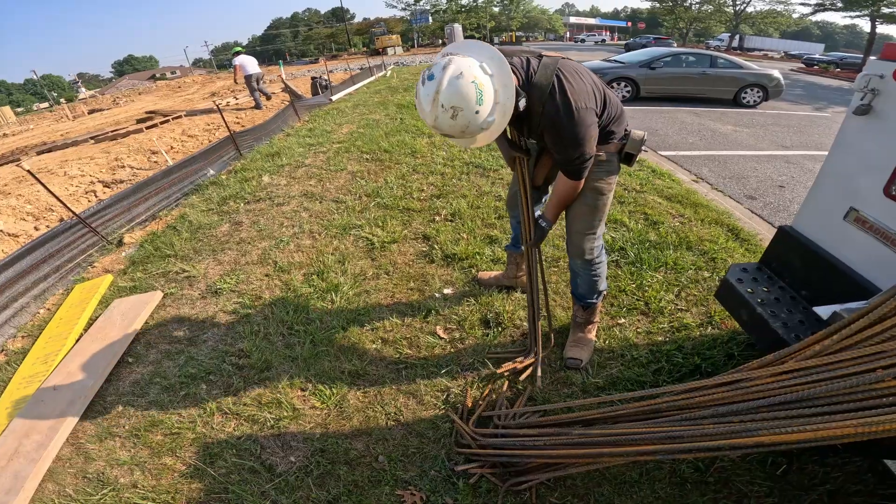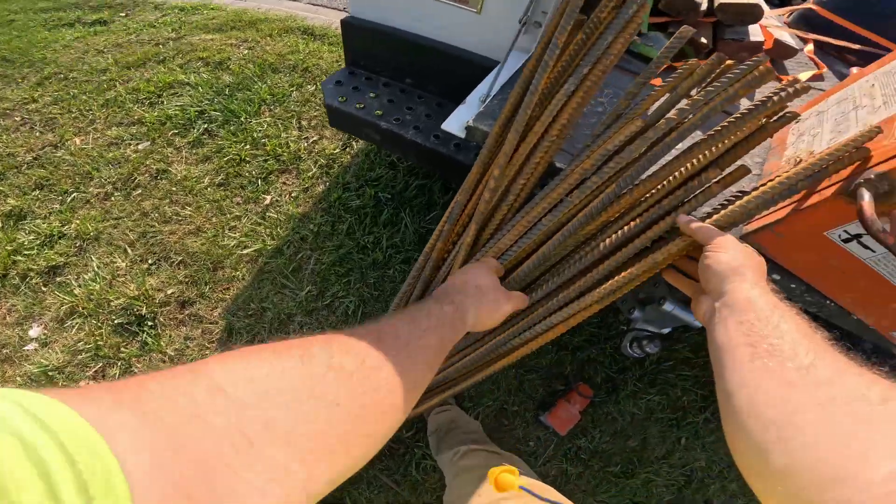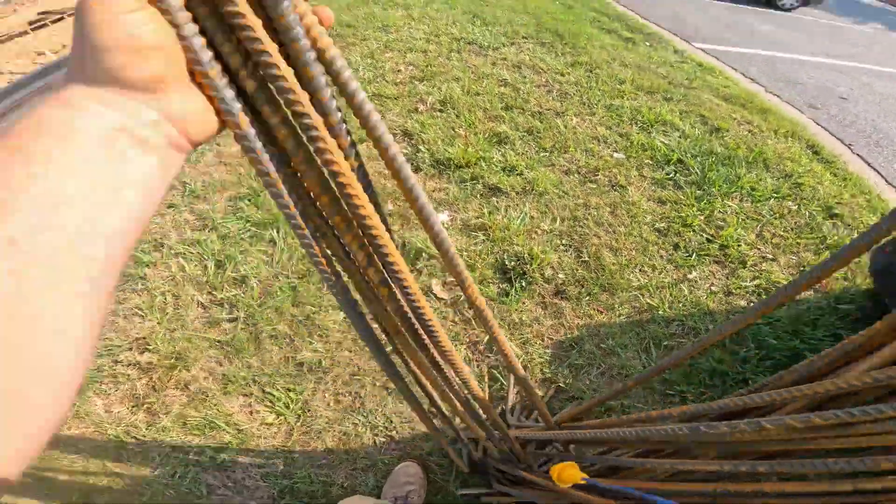Well, it's been a couple of hours. We had to get an emergency delivery of rebar. We cut and fabricated just under 300 of these vertical dowels because the plans got changed and nobody notified anybody from the engineering department to us. So we cut it, we bent it, we're almost finished putting it in. We've got to make some custom stands to get these heavy mats of number seven bar up off the ground to pass inspection. It's crunch time now, we got about an hour until the inspector shows up, so hopefully we can pull this off.